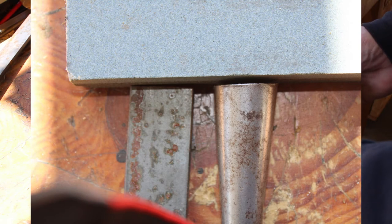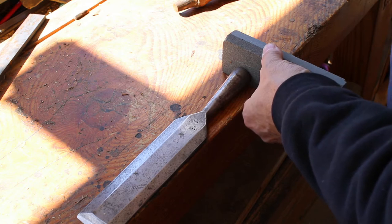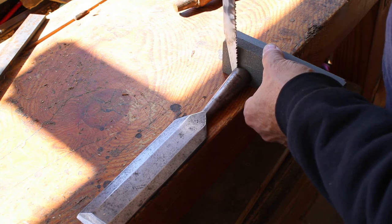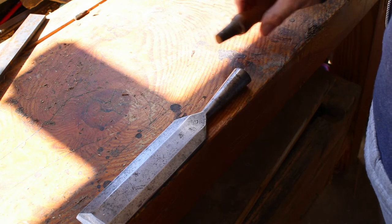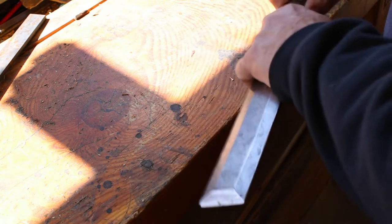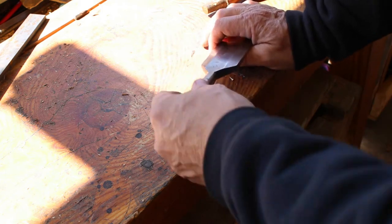Also, in a photo that I'm showing right now, there's a big gap right here. Seeing that to that, there is a substantial difference between this corner or this rim and this side of the rim by about 1/16 to 1/8 of an inch, and that would have had an effect on the handle. This one was put in and it seemed to fit just fine, but there was always a little gap. And when they epoxied it in, the glue that they used, which could have been epoxy, it could have been animal hide glue, I don't know what, created a big plug down at the bottom. And so I had to drill all that out.